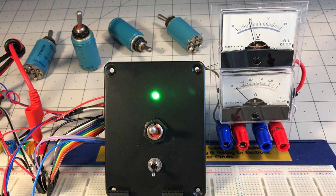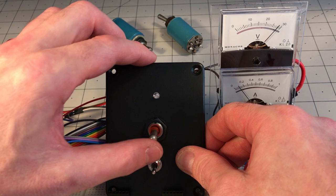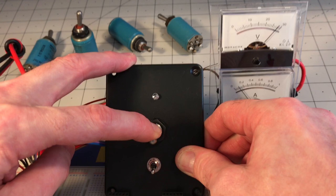Winding the voltage up: at 12 volts it's taking about 47 milliamps; at 15 volts, 58 milliamps; all the way up to 24 volts gives 91 milliamps; and at the rated 28 volts it's taking about 105 milliamps. It's worth noting that the latching action becomes extremely stiff at these higher voltages. When there's 28 volts on the coil, it's quite difficult to operate the switch with one finger — you certainly wouldn't knock it off by accident and you might have trouble doing it deliberately.